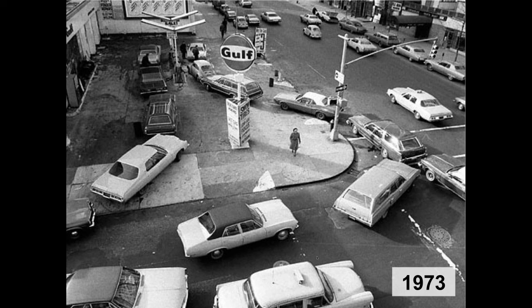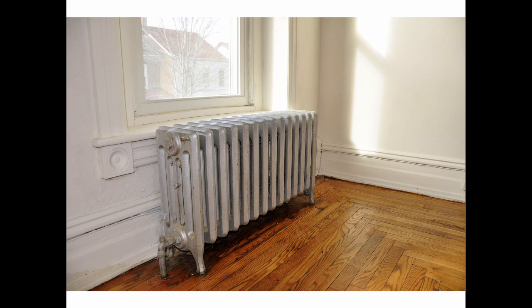And it takes off especially more in Europe than it does in America, because we're not ready for this yet, right? In America, we got our furnaces. We're happy with the furnaces. But in Europe, they're heating with these old radiators. They're doing like we were doing in our old cities. They're running 200-degree water through radiators that look like that. So suddenly, the German governments begin to step in and say, we're going to pass laws that say you can't use water that hot anymore. You got to lower the temperature, which makes radiant look even more appealing. And it also makes the radiator people get nervous.